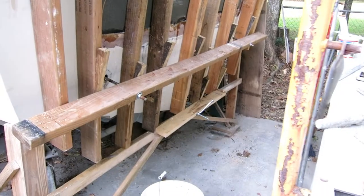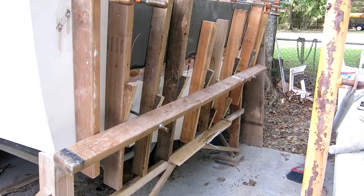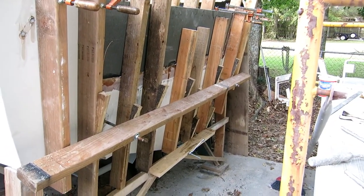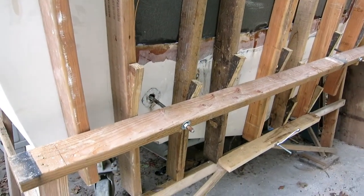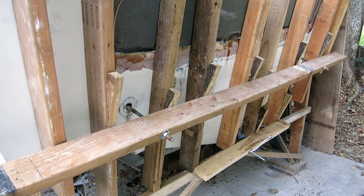Snake. There's lots of ways to brace off a transom. I've seen people use a million screws. That's what we did in a houseboat. Or different things, but this worked for me. I drilled two holes, and it's where the old scupper holes were, so hopefully I can just leave them, but if not, I just have to patch the hole in the Coosa board.